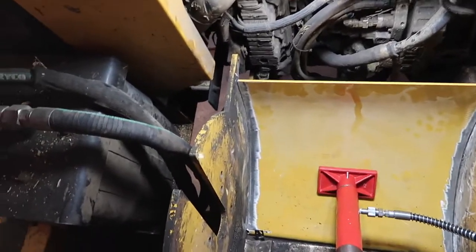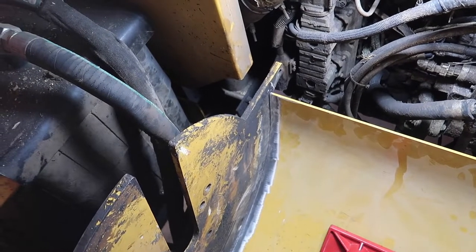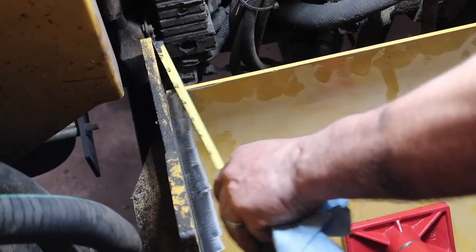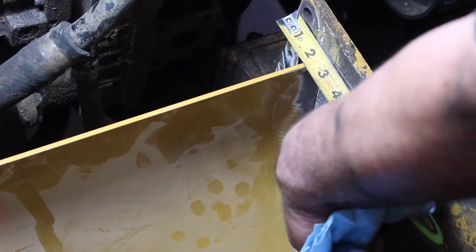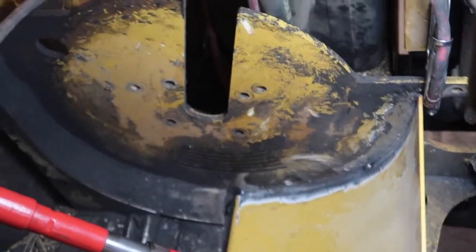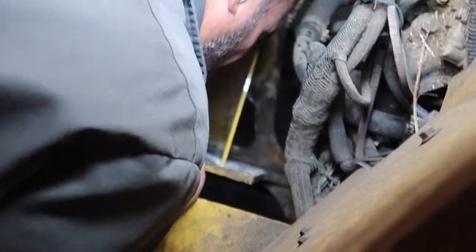That's where we're going, or we need to get. So you see it moving in. There it is. This one's far out. So if you measure it here, this one's at 2 inches, and I go here, and I'm at 2.5. So this side needs to come in about half a, about 3/8. So now what I wanna do is I wanna pump it a little bit to see if this side comes into the X where it marks the spot here.